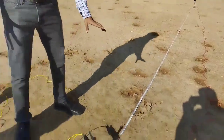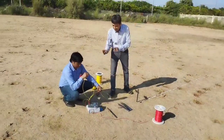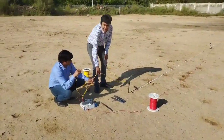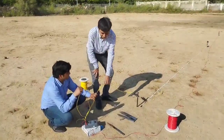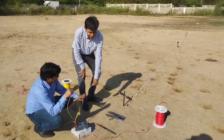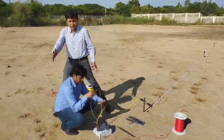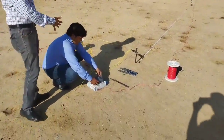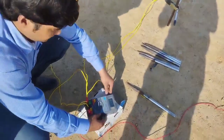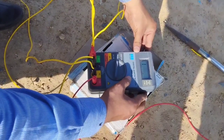This is the third method. When you don't want to bring separate wires from C1 and P1 up to the electrode to be tested, you increase the diameter of the wire. I have taken a double wire to increase the cross-sectional area, or you can use a thick wire instead of two wires. Then you make the short at the tester. Let's see what happens — the third experiment we are performing at site, at the same range of 200 ohm.